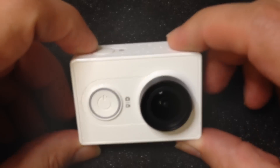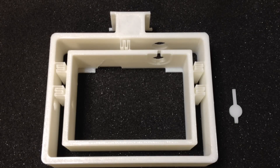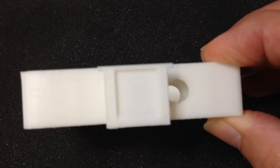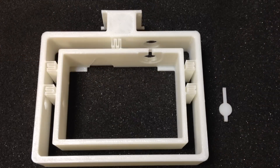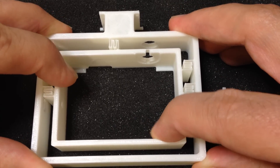But how do we mount it? The solution to the problem is pretty simple. We built a frame for the camera that protects the camera and reduces some of the vibrations put forth from the drone. We just need to make sure that the new camera mount fits the old camera mount as it did before. The camera mount is printed in PLA, it weighs 28.5 grams, and it can take up a lot of vibration put forth from the drone to the camera.